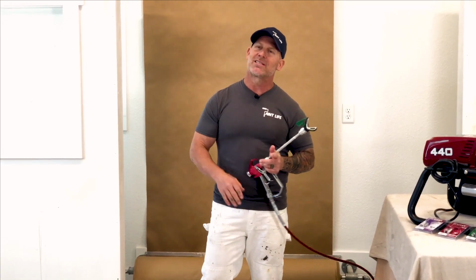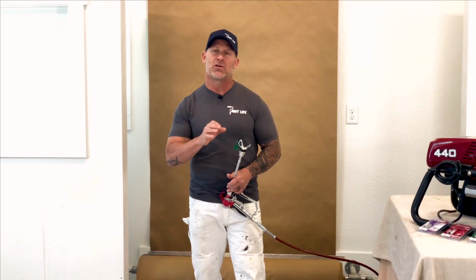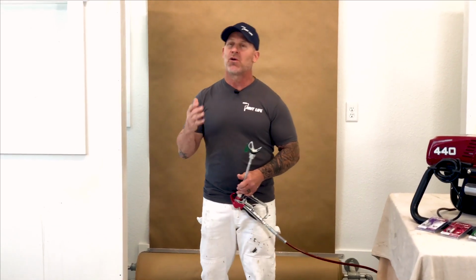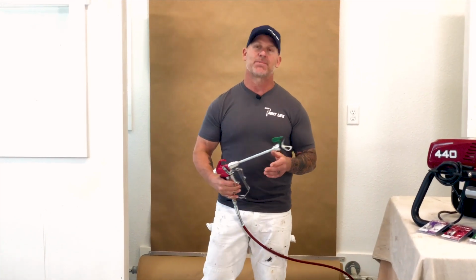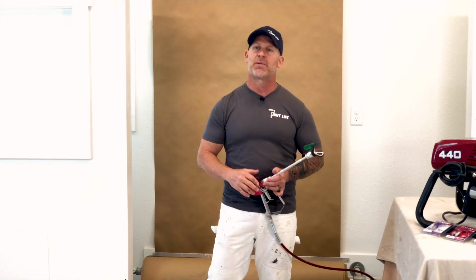On my production tips, I'm typically running my tips around 60 to 100 gallons. Probably right around 60 to 80 gallons is what I'm using those tips for. Once again, on a production tip, you're going to start to see a noticeable difference in your spray pattern as you start to get that orifice size worn out and as it starts to get bigger. You'll also notice a lot more fallout and overspray from the tips themselves. So don't try to push those numbers up too high. You want to replace the tips when they actually need to be replaced.